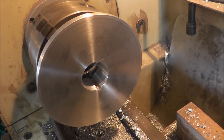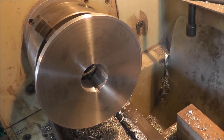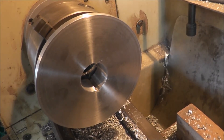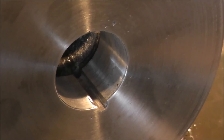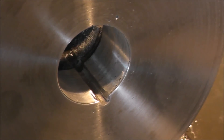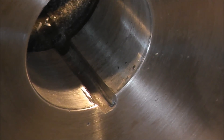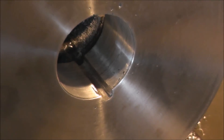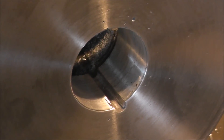There we have it all done basically. The shaft just barely slides in there — a nice fit. I took a file and cleaned up that keyway hole a little bit. A very easy way to make a keyway in something — just drill a hole and then machine it out.